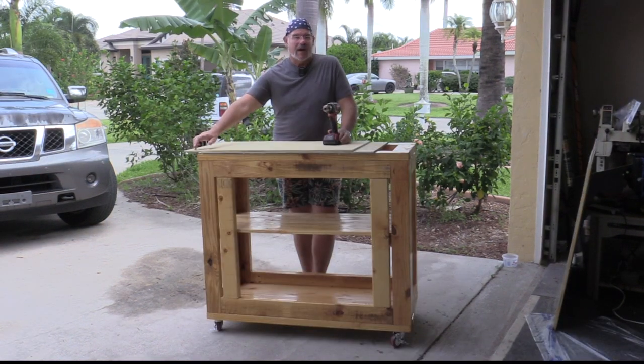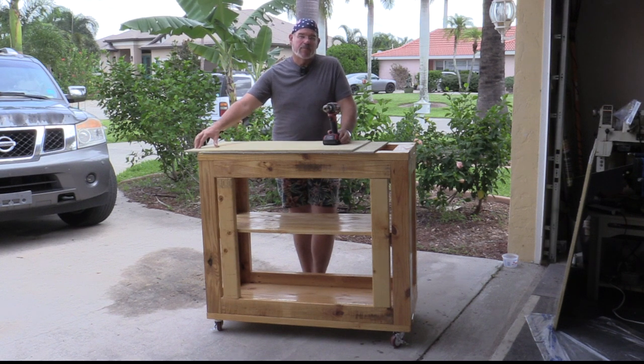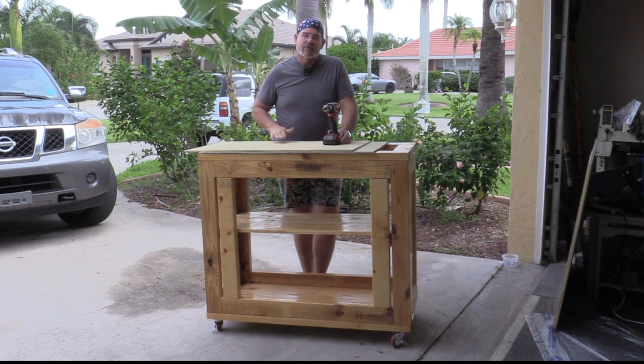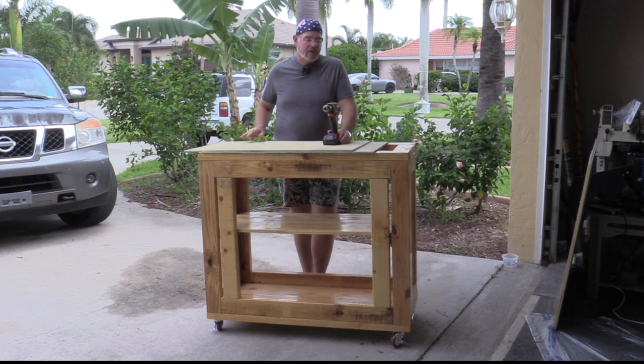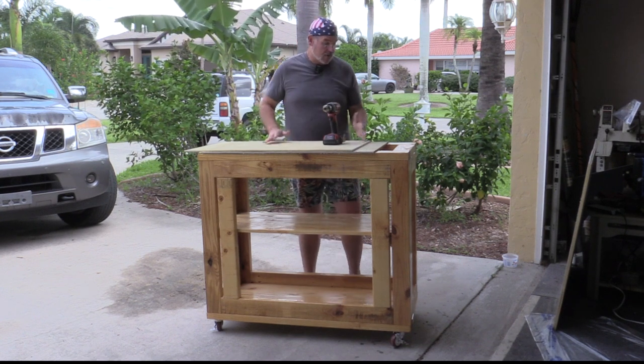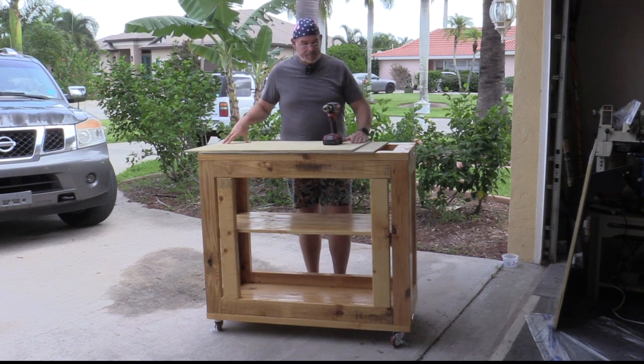What I'm gonna do is do pilot holes through every one that is as wide as the shank, but not the threads of the actual screws I'm using. I'm only using a 3/4 inch long screw. It doesn't need to be all that long. That gets me through the plank and then twice that length into the actual 2x4s behind it. I'm also gonna countersink them so that they're just below the surface of this. So I found the drill bit size I needed and made sure I knew how well all this drilled. So now I'm just gonna go ahead and start pre-drilling all the holes in the countersink spaces.